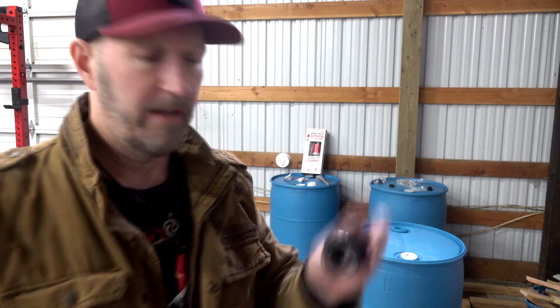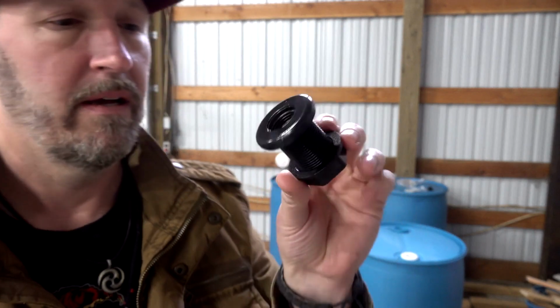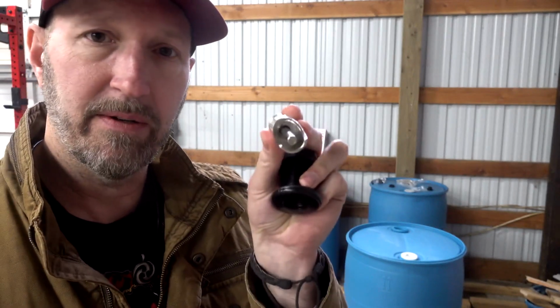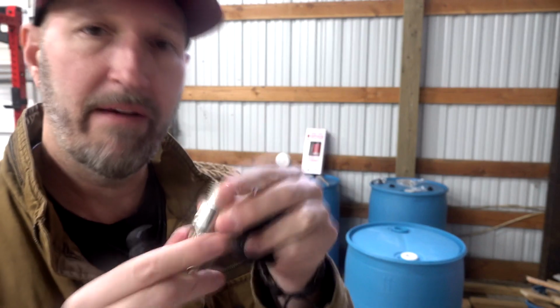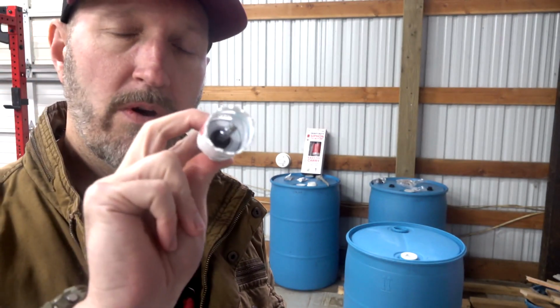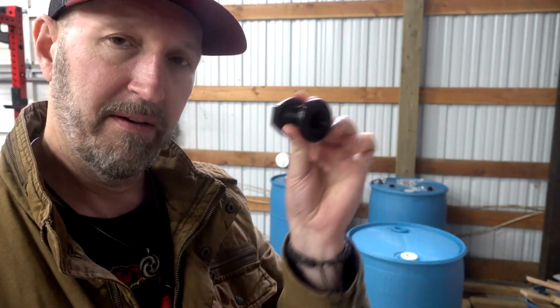Here are the things that I ordered to make this possible. This is a bulkhead, and I'll put a link in the description for you, and that is a 1/2-inch thread. And then I've got the actual little nipple attachments that I ordered. And they are 1/2-inch thread as well, so they will go straight into here like this. And then I got a 1 1/4 inch hole saw, and this is what we're going to use to drill into the side of the drum to make possible the bulkhead insertion.